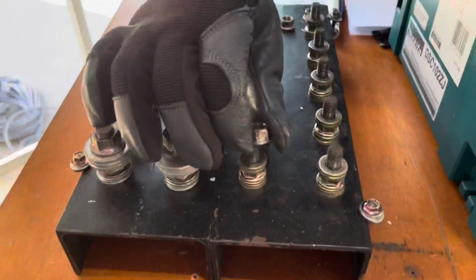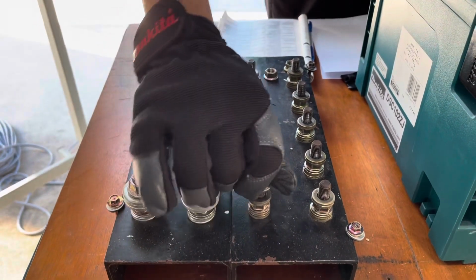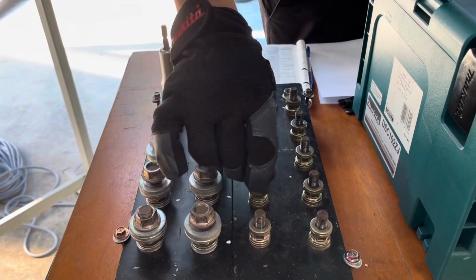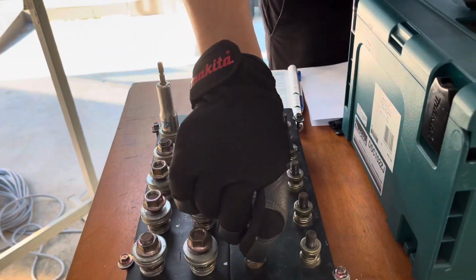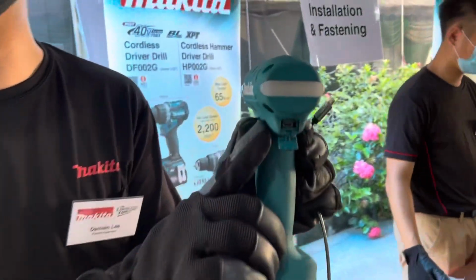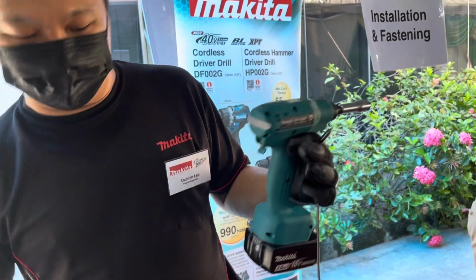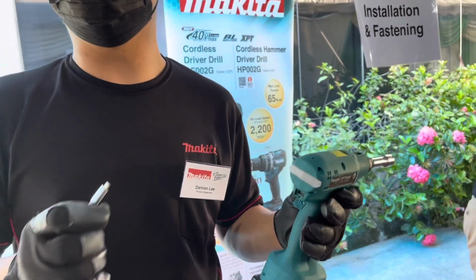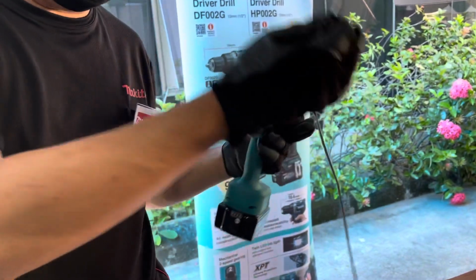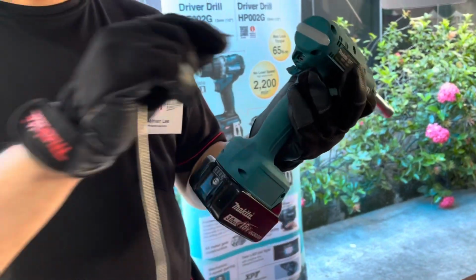For example, normally we turn the nut anti-clockwise for placement on the bolt and then clockwise to fasten the nut. With this tool, you can set, let's say, 0.5 seconds on counterclockwise and clockwise for 4 seconds. The tool is also suitable for the automobile industry and other industries that need precise torque control.